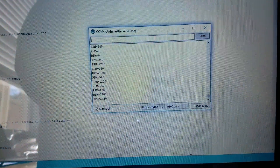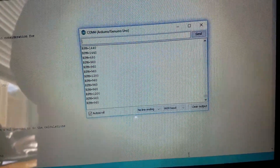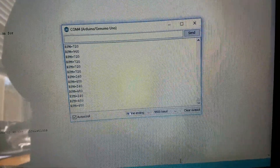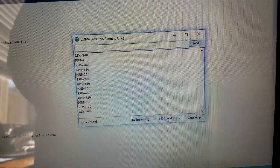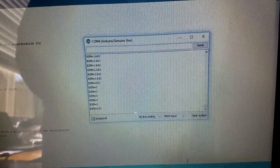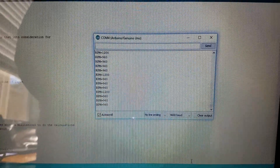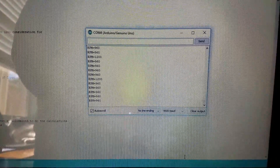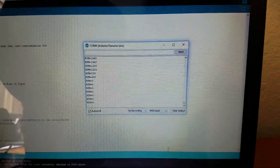When you spin the magnet in front of the sensor, you get RPM feedback. The Mach 3 software probably has a better algorithm for calculating RPM than this Arduino sketch I just made, but you get the idea. The magnet has to be within a few millimeters of the face of the sensor. So it's that simple.